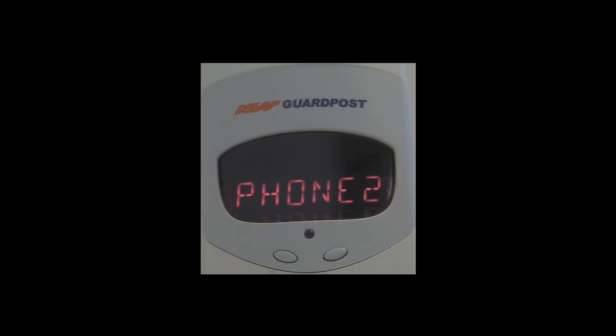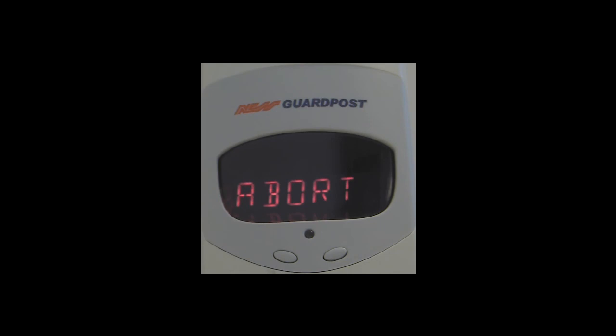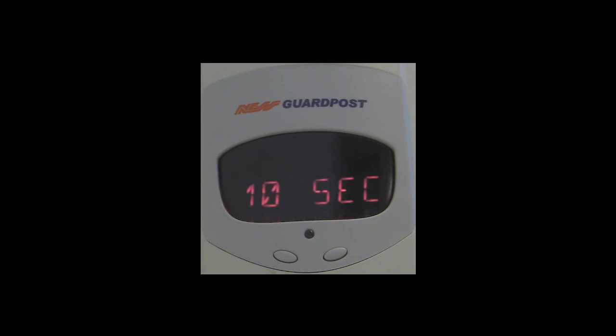Pushing the off button on the radio key takes us to the next option, which is GSM signal strength. If you are using the GSM dialer in the SG3, push the on button to go into signal strength and the SG3 will display what the strength is — zero is for a very low signal and nine is for a good signal. The next option is Abort, or dialer abort delay — this gives the opportunity to abort sending an alarm message to a central station within the programmed time if there is an alarm, giving the customer time to disarm if they accidentally trip it on entry. To program the abort time, push the on button, and each subsequent press steps you to the next time — adjustable between zero and sixty seconds in five-second increments. Once you get the setting you wish, push and hold the panic button to save your options.